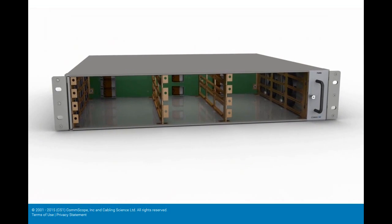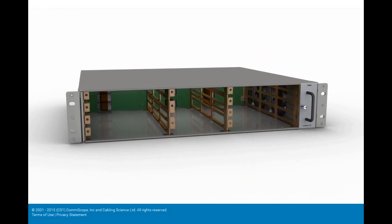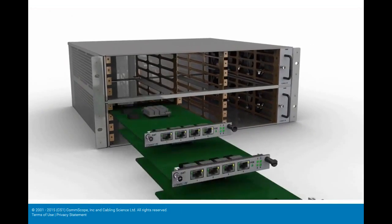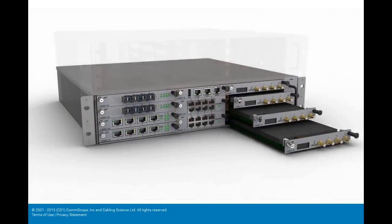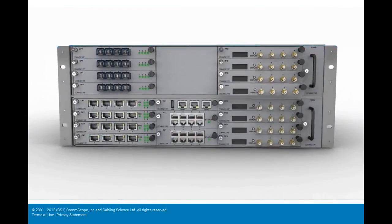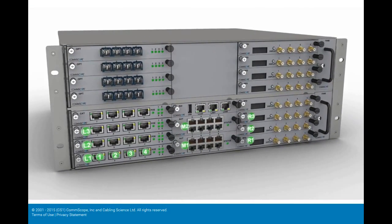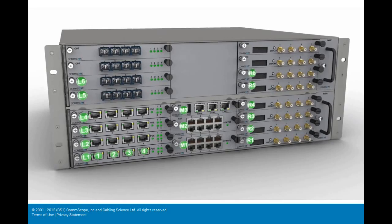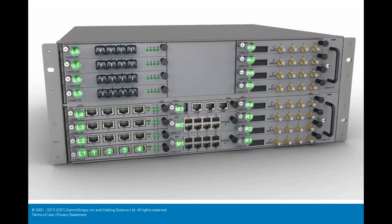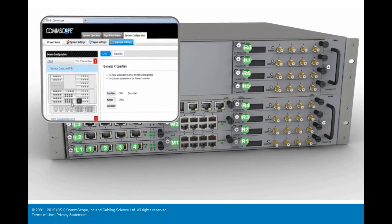ION-E's simplified design comprises just two 19-inch rack-mount Wireless Communications Switch, or WCS, subrack types, the 2U and 4U. Each is configurable with a selection of universal cards to support various transport options. The 8 extra card slots support additional RF donor and optical transport cards. Each card is numbered to assign a specific ID to its card. For enhanced consistency, the WCS4 uses the same slot numbering scheme as the WCS2. In both cases, the card slots are numbered from the bottom to the top of the subracks.